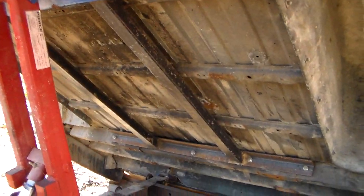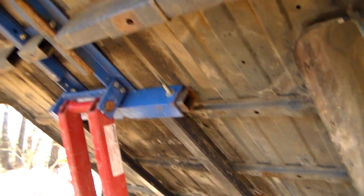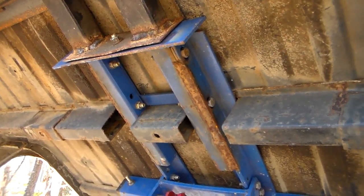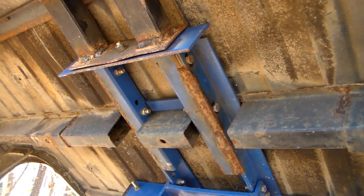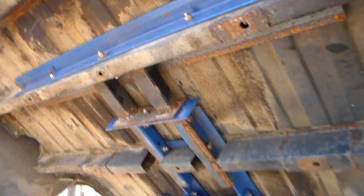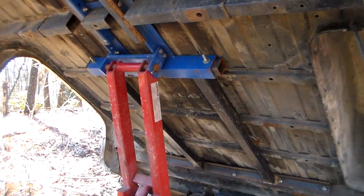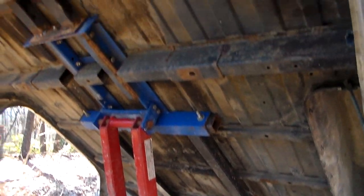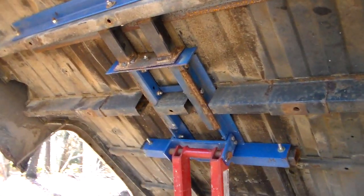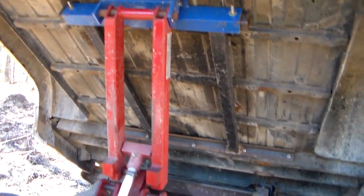Here you can see where I had to add in some brackets to make it fit the spacing on the bed from the Super Duty. Cutting through these cross members was killing blade after blade — these old beds have so much thicker and harder steel than the new ones. That's actually why I moved it off my Super Duty; a really heavy load almost folded the bed floor in half. This truck is so much more solid, so I'm really happy with it here.